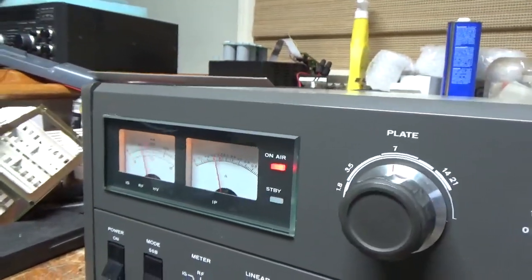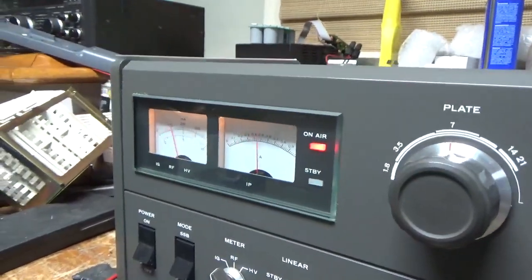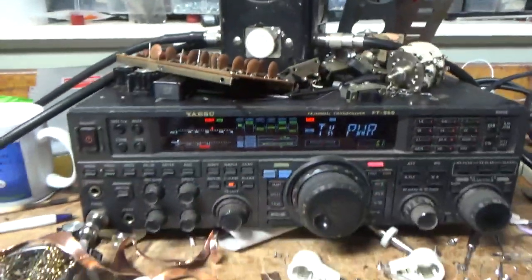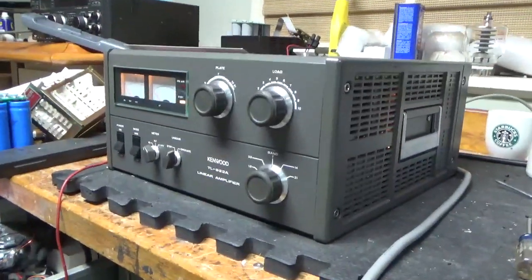RF upload. Works as it should. So, nice. I'll crack it open and I'll show you the inside. I'll be back. So, here's the inside. One of the new parasitic assemblies — see there? 350 ohm resistors in parallel. I have over 1,000 of these. I know it's overkill, but why not.